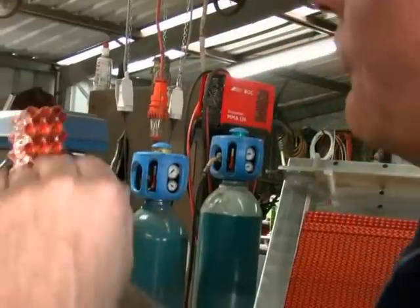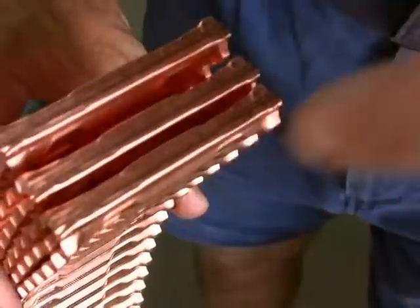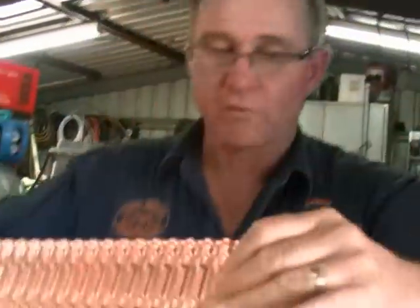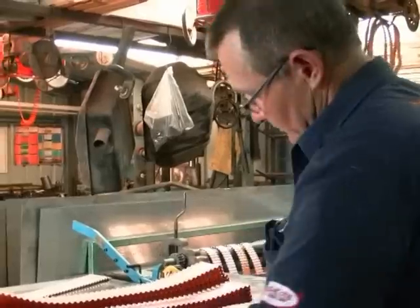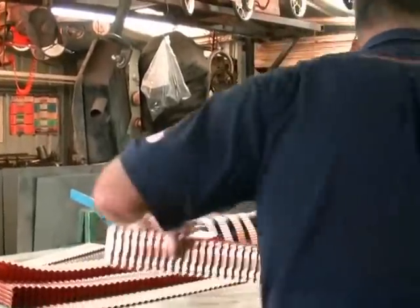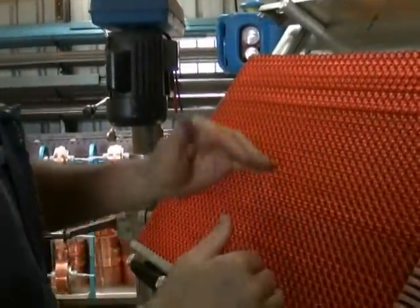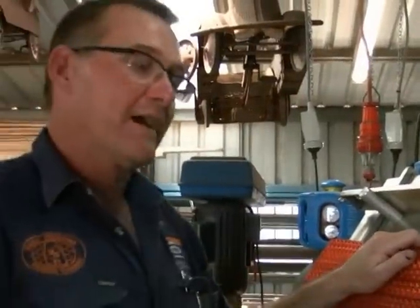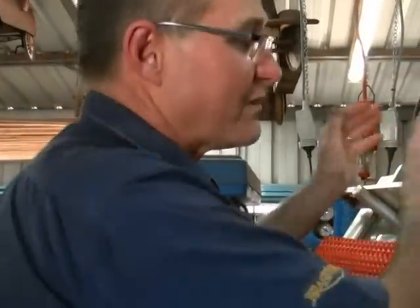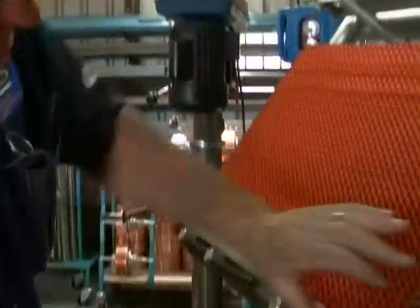This is the water side — the top tank fits on there, and that's the air side. So we've created some honeycomb core. We take those over to the stacking bench — they roll as they come over and land on here. You'll see some that I've done earlier. We need to go back to the core build sheet: I know this core is 486 millimetres. On either side of the core I have a brass strip — you'll see the brass in here.